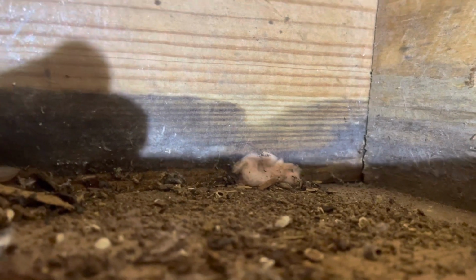This is a little bit better view of the same joist pocket. I'm poking in this area here with a little prod. Doesn't seem like there's anything we need to do structurally. The sill plate is fine. The band board, of course, is really not much left of that.